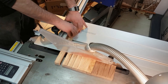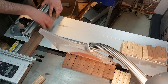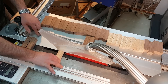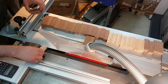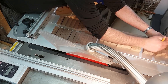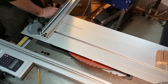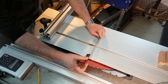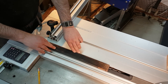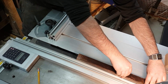Here I'm slicing the walnut into stripes. Now I'm cutting it to small blanks in the desired length - owning a sliding table saw really makes this work quick and easy. I numbered the pieces so I can check for misalignment later on. I'm changing the blade angle to 45 degrees - I never had to fix the angle after using the stops of the saw.